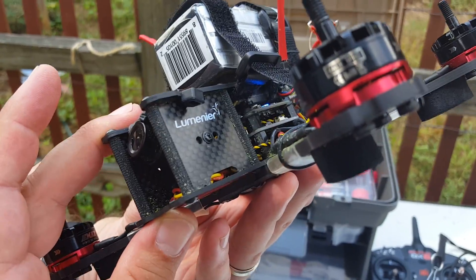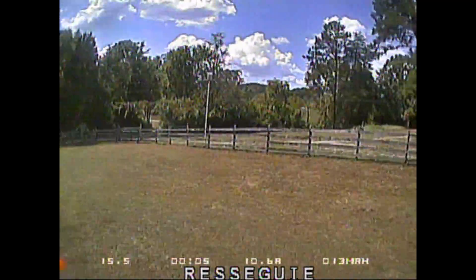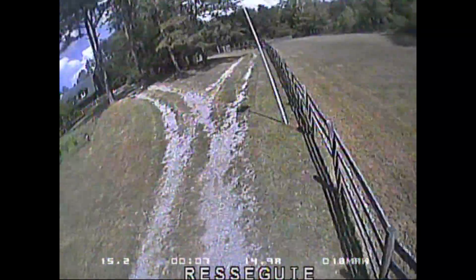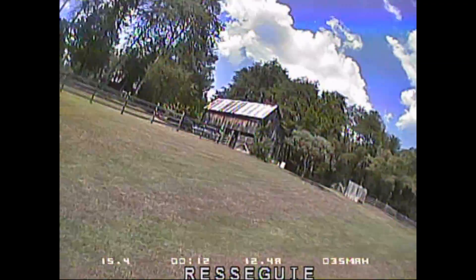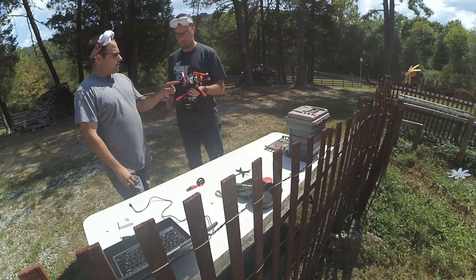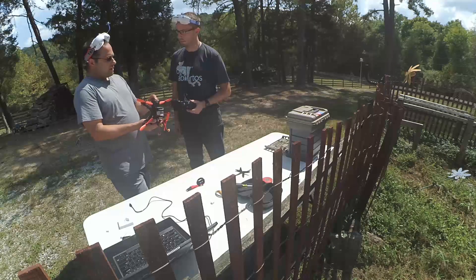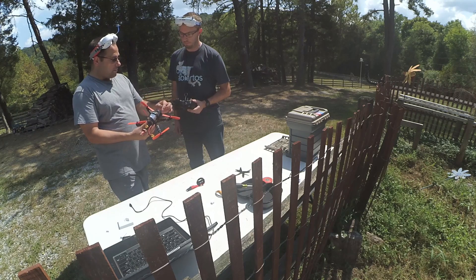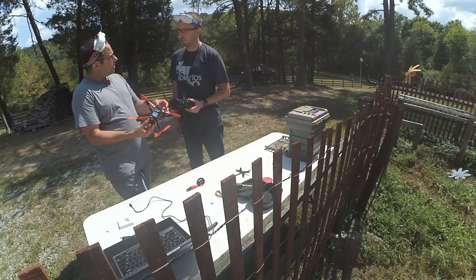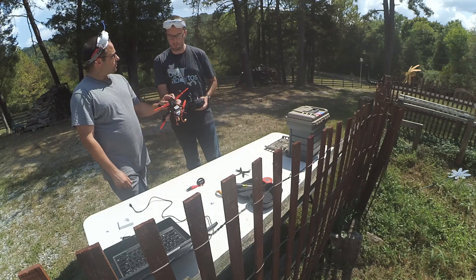That's too obvious not to check. Here's the footage with the camera restrained as shown — you can make your own judgment as to whether it's better or worse. So we restrained the camera and that made it much, much worse. That does make me think that maybe we have a loose sensor in here, and when the camera is unable to move it made the vibrations worse. We've affixed the camera to the frame more securely, so we're transmitting more vibration to the camera — and maybe you do have a loose sensor in here. So let's swap the camera out.